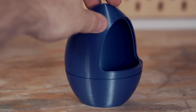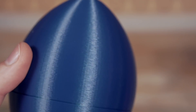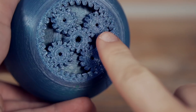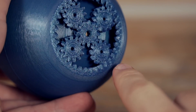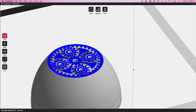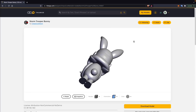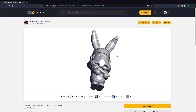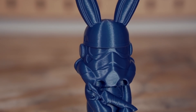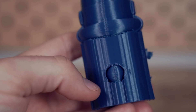I tried 3D Printing World's planetary egg model — the actual egg looked great, but I wasn't able to get the gap just right for the gear system on the bottom. I believe the issue is the powder-coated PEI: the gears require very precise spacing, and with powder-coated PEI the first layer pushes into the bed more so than with other beds. I'd recommend using smooth PEI, glass, or build tack for a bit more clearance on the first layer. Next, I sliced up Chaos Cortec's Stormtrooper bunny model, which requires a fair amount of support. I started with Cura tree supports, but they weren't dense enough to support the bottom of the helmet and one of the arms.